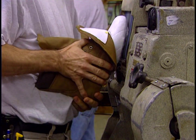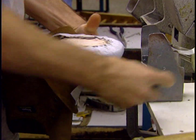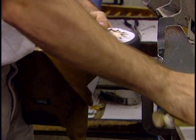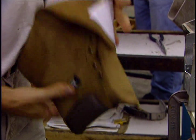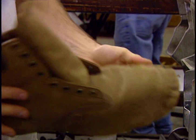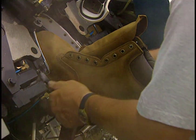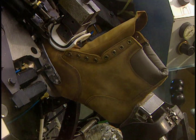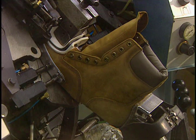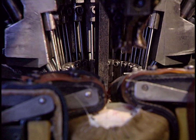They now install the tempered steel toe cap. The lining is cooled. They insert the cap and fix it well in place. The leather is folded beneath the boot, the bottom secured with a tack, and the sides fastened with hot glue on this seat and side lasting machine. The boot front is now finished. We get a good view of the application of the hot glue.